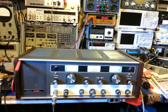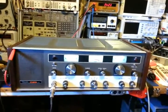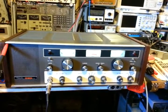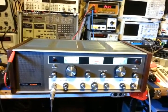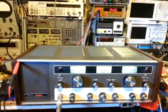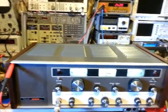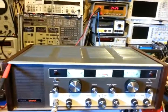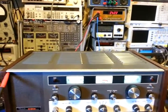We have a Tram D201 that came in for repair. This is the second version, the 23-channel model with circuit boards, made in Mexico. The complaint was a pop and smoke — actually it was steam. The cathode capacitor on the 6L6 audio tube had vented to the atmosphere. It didn't completely blow out; there's a small hole built in so if they over-pressurize, they vent.